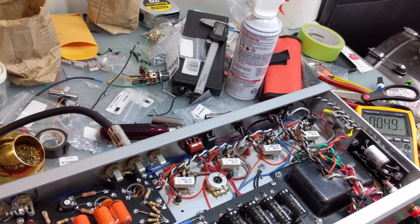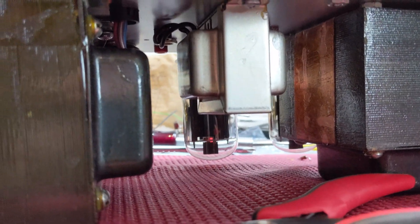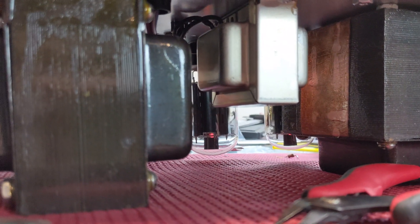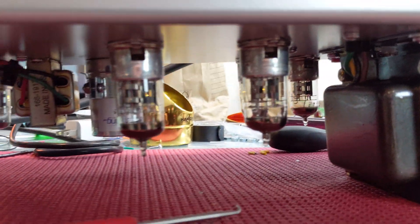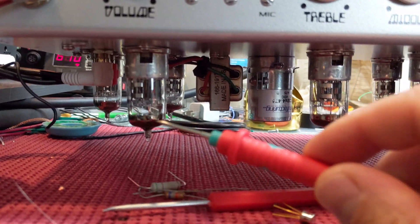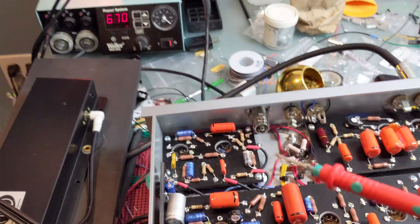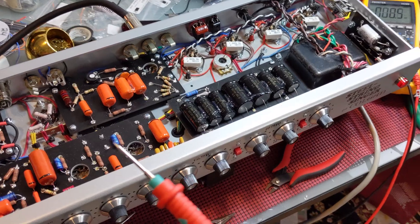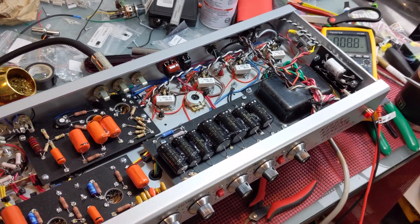That was a lot more dissipation for these 30-watt tubes. I went with Tube Amp Doctor 6L6 WGC STR tubes — I love them and think they're a perfect match for the Steel String Singer style. For the rest of the tubes, they're all Tube Amp Doctor as well. The reverb tube, which has all the cross connections, is a 12AX7.